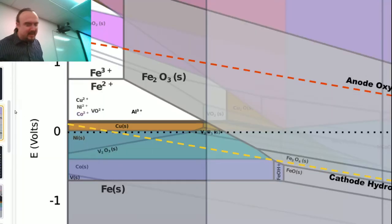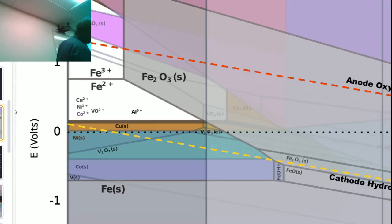Super close-up of that region — I've been staring at this so long it makes perfect sense to me. The basic idea is: if you're here — basically pH around zero, really acidic, and slightly oxidizing — all the metals are in solution. If I start applying voltage, the first thing that plates out is copper, then nickel, then vanadium oxide and cobalt, and eventually you get iron at the high end. Basically, if I just run electric current through here, I'm going to plate all of these things out. But it turns out there's not that much — there are parts per million of copper, nickel, cobalt, et cetera — not that much of those things.